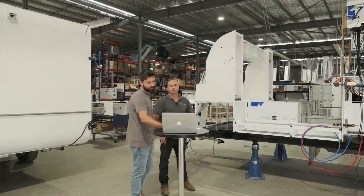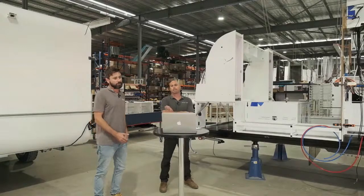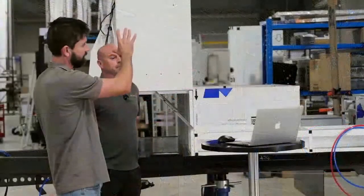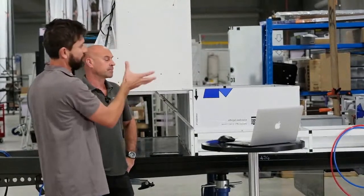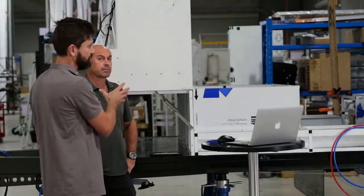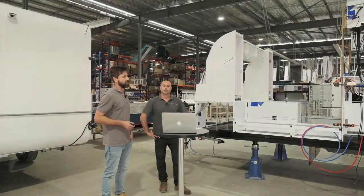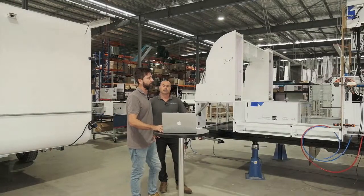What's the main weight savings compared to competitors? There's a question here which probably circles back to the same thing, but where are we getting our weight savings in these vans? Everything I'm talking about that's happening on the exterior of the body gives a stiff structure, which in turn gets us to pull steel out of the chassis. That's probably a key one on the exterior. On the interior, we're using a bunch of sandwich panel structures, and we're achieving a lighter weight, stronger structure using these materials than timber. Couple those two things together, and that's where we're getting our weight advantage.